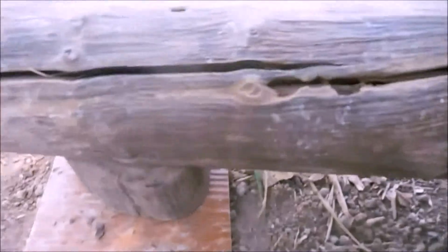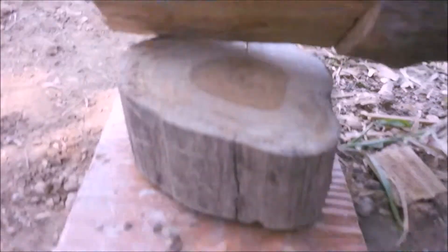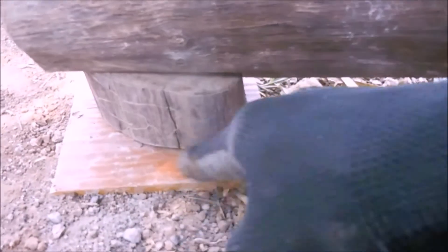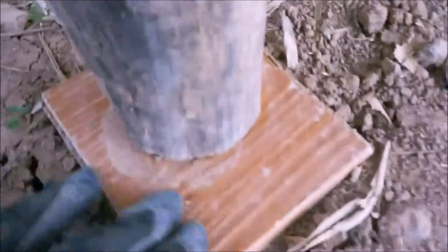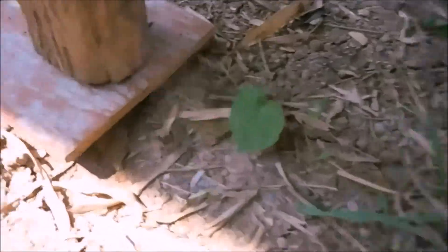If I get up close, you'll see how that looks. You can see the flat joint nicely on the stump with a barrier, and the termites can't come through it — they've got to come around it with a clay tunnel, which you can see and clean away if they come around. You do that same thing for anything you make. There's my bed — you can see the weather boards, tiles under each leg, and a steel biscuit tin lid, just like that, for all four legs. And that's how you prevent termite damage.